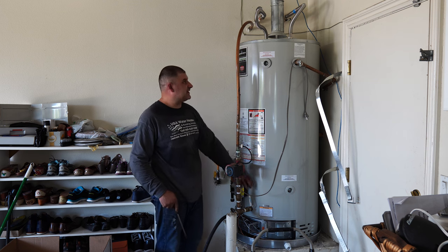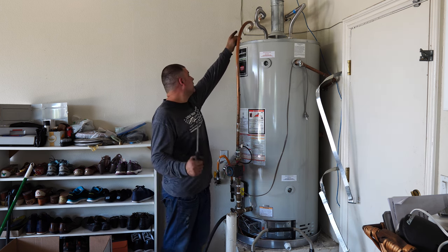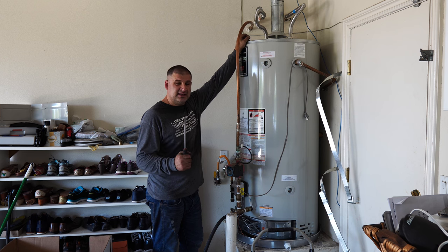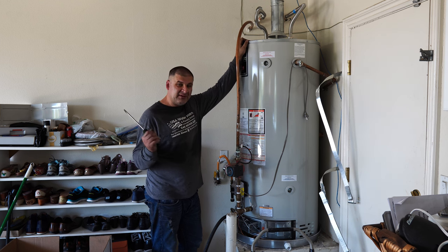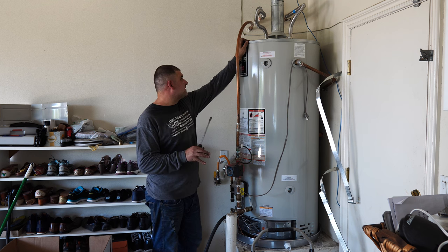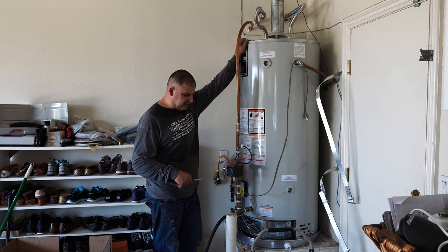So eventually what happens is the air that's at the end of the house will come back to that return line. The return line starts from the end of the plumbing system's hot pipes. And that way I can release the air from the plumbing system without having the homeowner go through all his bathrooms and open all his hot water faucets and taps. So this is like 95% efficient. I can get the air out through the plumbing system this way when you have a return line.